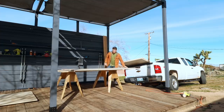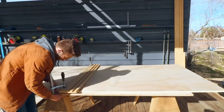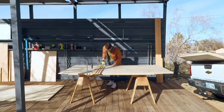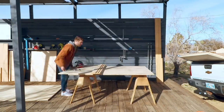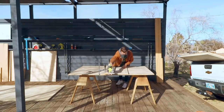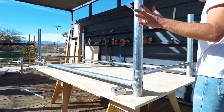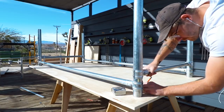With the base done it was time to create the tabletops. Each table will have a finished dimension of right around 10 feet by 4 feet. I started by breaking down two pieces that join together to create the top — each cut 4 feet wide by 5 feet long. I also cut two 12-inch long pieces for the bottom. I'm using my DIY track saw for my circular saw. This 8-foot piece along with the two 1-footers make up the bottom layer. I centered the base on the plywood to mark and cut holes through it with a hole saw.